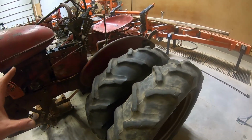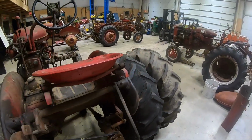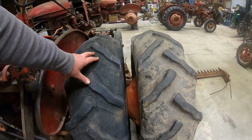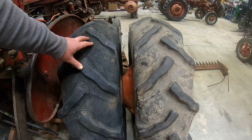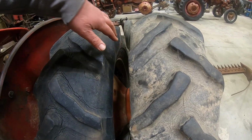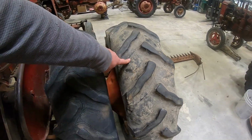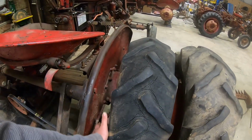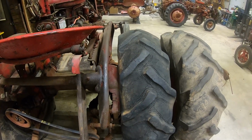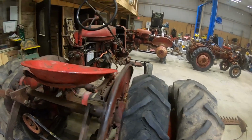But now on the other side, they're both thick centers, so we've got 2 thick ones side by side, and it gives us a pretty decently even gap there. It may be a half inch or so different, but you can see the orientation we have is this one is run one position from the narrowest, and this one is run on the widest, so that gives us room to still get in here and wash it down and access bolts and things like that, yet still give enough that they don't kiss at the bottom. We probably got roughly a 2-inch gap or so.